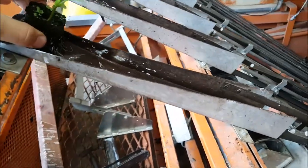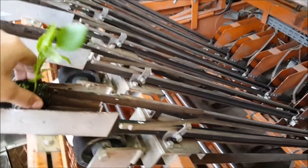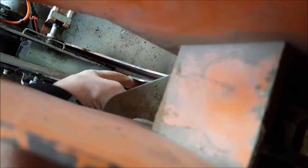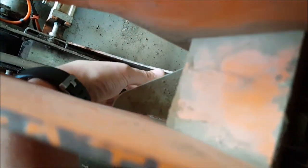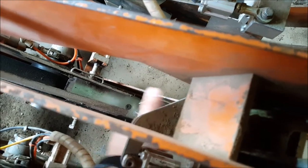You get two people on the back here, and then you place your — you have these in lines, cut them up into lines, and these blocks will slide down here. It's all computerized so it knows how much is on the rails and that. It'll come along, gets down to here, and then you've got these little arms at the bottom which open and close — grab your little blocks of peat. At the minute that is set to receive, so it grabs a block of peat like that.